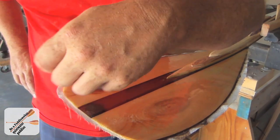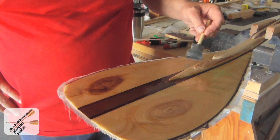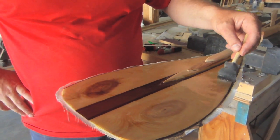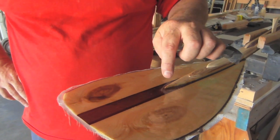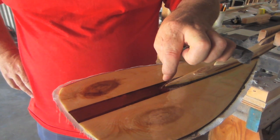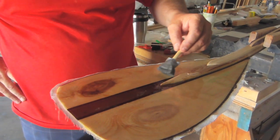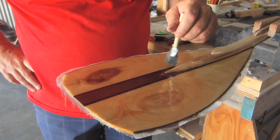I do pour a second coat, and that second coat is about half the size — roughly three teaspoons. For good adhesion between the two coats, I like to put my finger down. When my finger still leaves a fingerprint but the tip of my finger comes away dry, that's when I put the second coat down. I don't like to go sooner or later than that point — the best adhesion between coats comes when it's right at that tacky stage where you can still see your fingerprint but your finger comes away dry. I'm going to check this in about 45 minutes for my fingerprint, and we'll be back for the second coat.